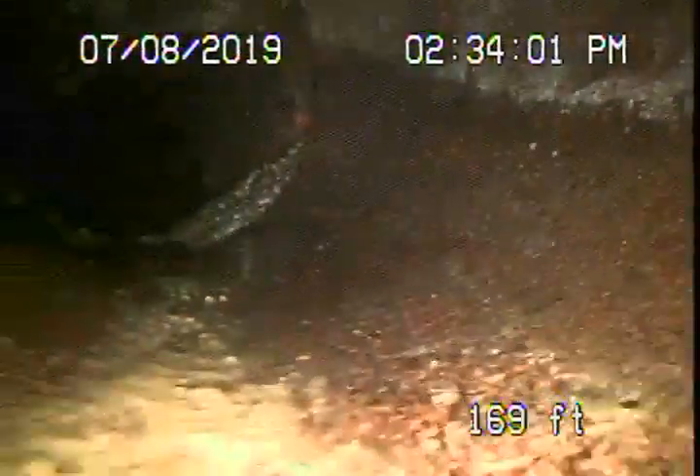You can see the city sewer flowing by here. We're going to pull our camera back very slowly. Here's the connection to the city, and it appears that somebody installed a cured-in-place pipe lining. I'm not a big fan of linings, especially if roots are concerned — they're basically just temporary fixes. But right now the lining looks like it's in pretty good condition still.